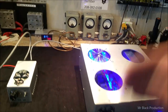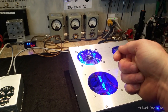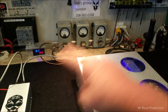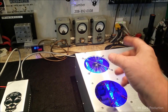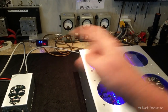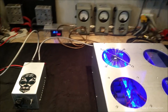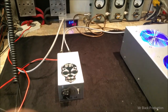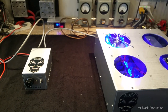So you couldn't take 12 feet of coax and hook it up to the back of the box and have the meter read the line section at the back of the cabinet properly, because there was already another 3 feet or 2.5 feet of coax between where the line section terminated on the back of the cabinet. You see what I'm saying? A lot of people don't build like that anymore. I'm just saying it's still out there, but for my stuff, it doesn't make that big of a difference. I can put a 1 foot jumper or a 2.5 foot jumper or a 3 foot jumper there, and the metering just stays the same.